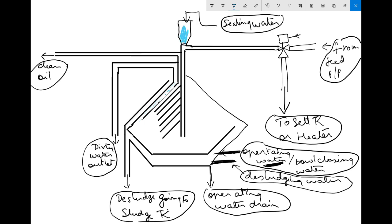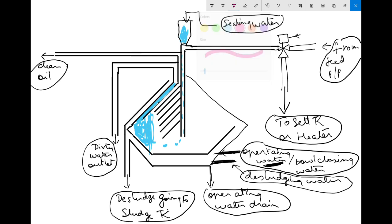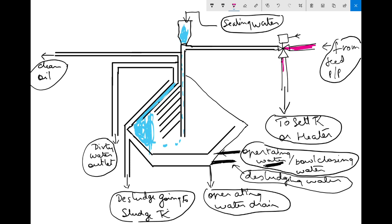Then start filling the sealing water inside the measuring cup. Once you fill the sealing water, let it go down — it will settle and block the area. The top disc is a bigger size so that it blocks the area for oil. Now the feed is still in a stop condition, so after giving sealing water you can start the feed. Once you give the feed, whatever oil was going to the settling tank will now go back to the purifier and oil will take its place inside. The interface will be maintained slowly, and oil will start flowing out through the clean oil outlet.